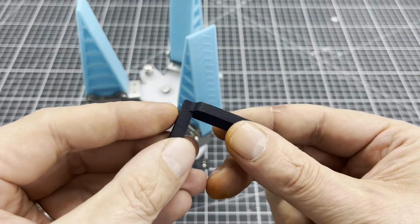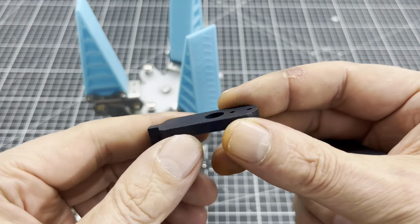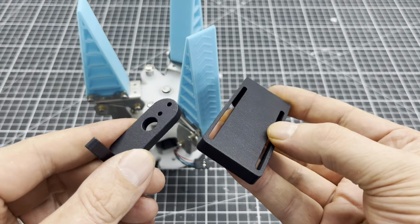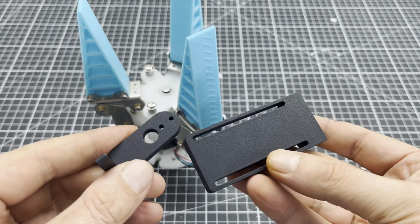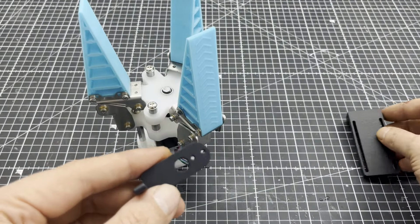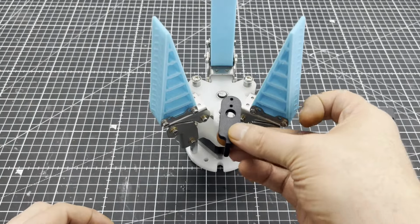The stepper motor doesn't have a closed loop control. Precise knowledge of the motor position is only possible if the motor never loses steps. Since there is no space for an encoder, I wanted to have at least a defined homing position. I achieved this using a photo interrupter, for which the two 3D printed parts are intended.